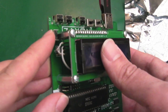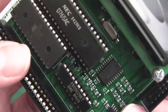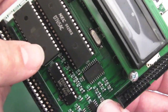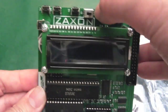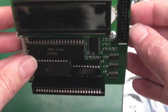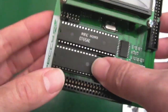There's a reset button on the side there — pretty sweet. The other switch up here — you'll notice we've got a large chip down there, that's a ROM. I think it's an AT27C512R, actually — that's the same chip I've been using for PLA replacements. It's got Parados on it, so you can switch over — I think this is the right-hand switch — between the built-in ROM and Parados. I'm not that hot on the differences between these things; I'm quite new to the CPC, a CPC newbie. For questions like that, your best port of call is Novabug or SmoothMJ.